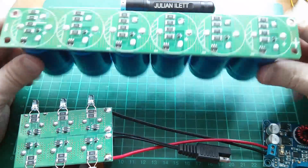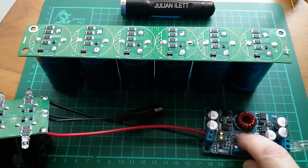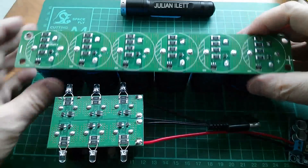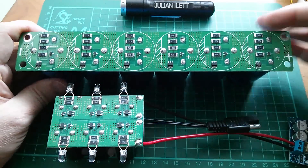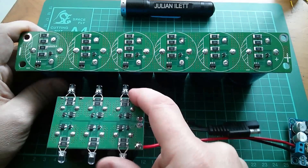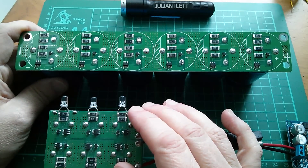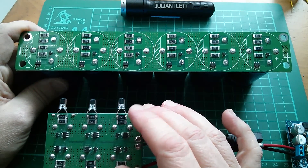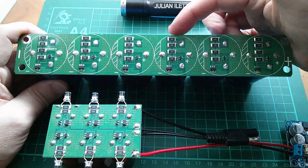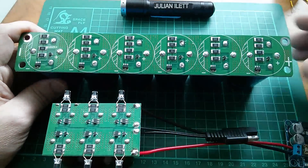I fancy having a play with this today, and I'll probably take this buck boost converter off this smaller supercapacitor module. It'd be quite useful to put blue LEDs across these resistors. That works because the voltage on the capacitor when this protection circuit switches on - and therefore the blue LED comes on - is 2.7 volts, so that's not enough to cause a high current through the LED. So just solder six blue LEDs across these resistors and they act as indicators for the overvoltage protection circuits.